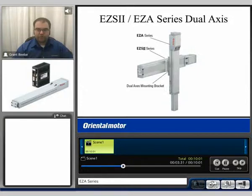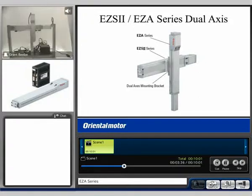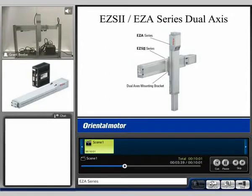There is a demonstration unit to share. We have an EZ-S series EZ-S4 slide with an EZ-A4 series actuator. We have a closed loop stepping motor along a linear guide. Inside is a ball screw with a ball nut, and motion comes out of the cylinder at the bottom. Here is the type of motion it's capable of achieving.